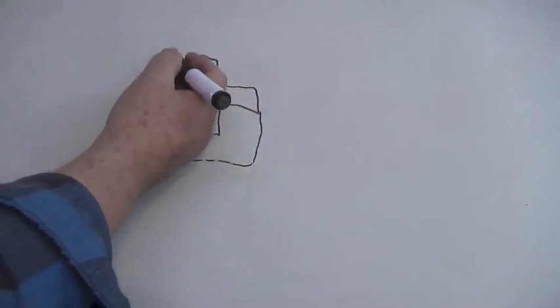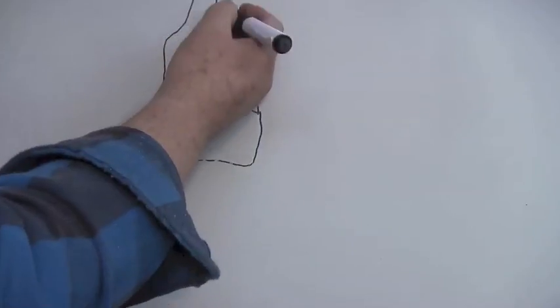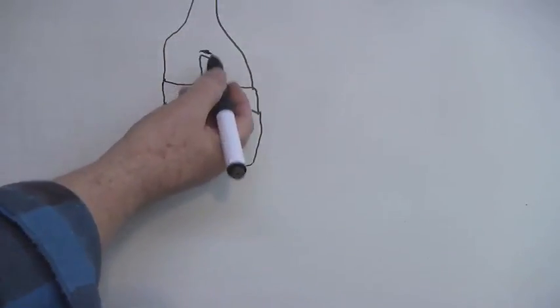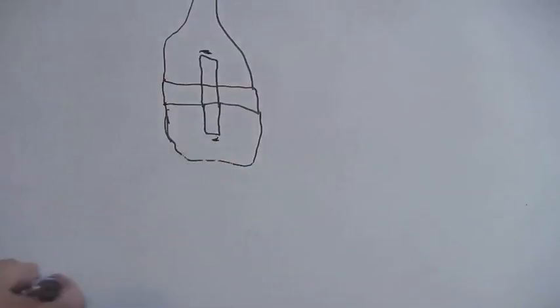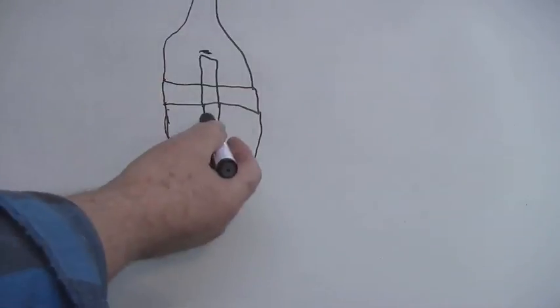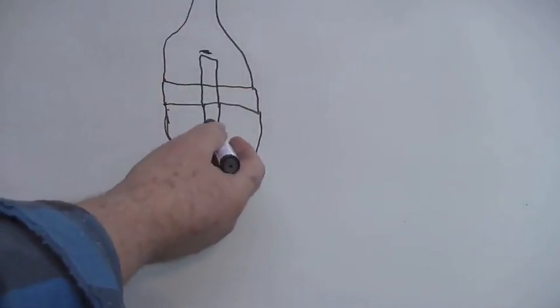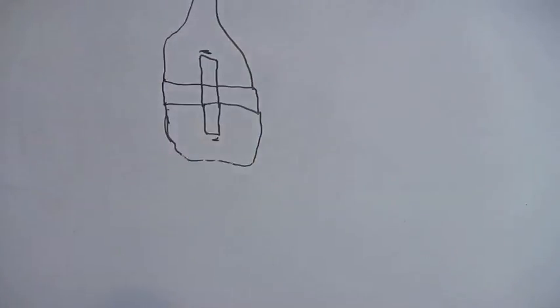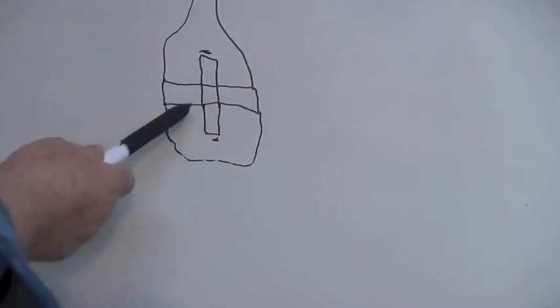And the top piece has a hole drilled in it. Of course, you leave yourself a little room to bottom out. Then you use epoxy glue and you glue this piece of pipe in here and in here, and you squeeze it until the epoxy dries. And then you turn it just like you do everything else. But now to make a bowl, I can't have a piece of pipe running down through it. So that's why I'm going to try this method, and we'll see what George comes up with.